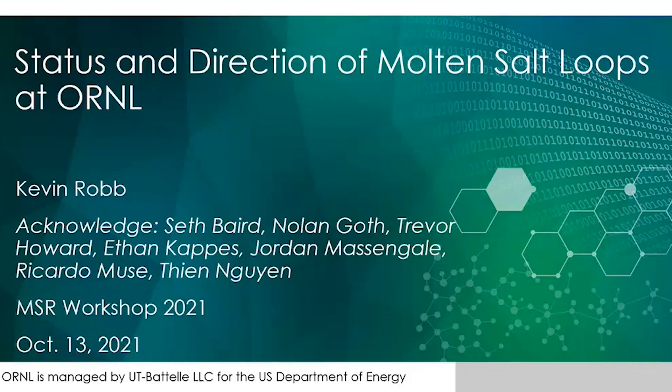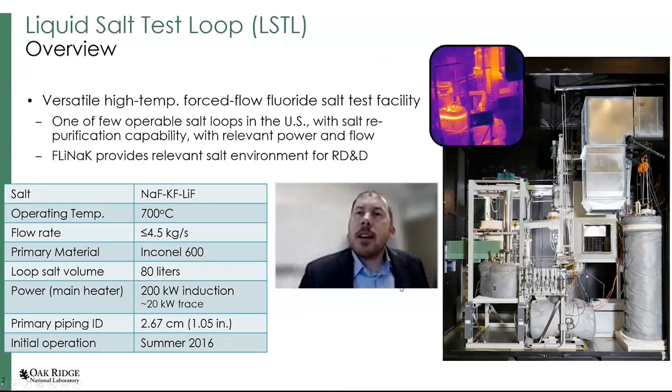It takes a lot of people to get work done and make stuff happen. Looking at the salt test loop — probably a number of you know that this started a number of years ago. This loop has FLiNaK in it. On the right, that large vessel is a purification system, so we use hydrofluorination to purify the FLiNaK. The tank at the bottom is a storage tank — you store the salt in it when it's not being used, and the loop is this kind of rectangle where this is the pump tank. Salt goes up, goes across, and goes through an air-cooled heat exchanger, then comes back.